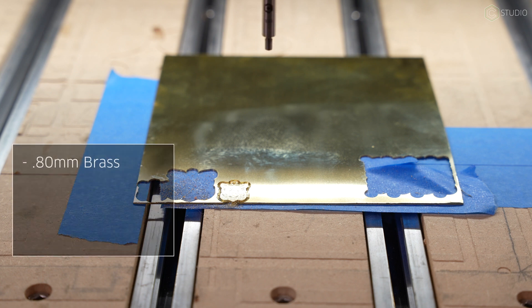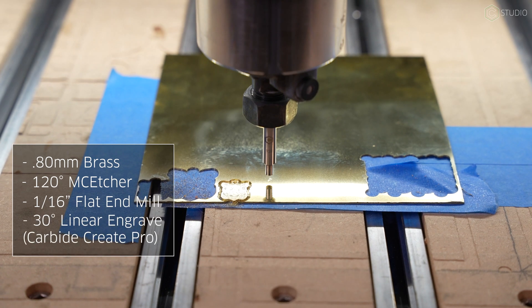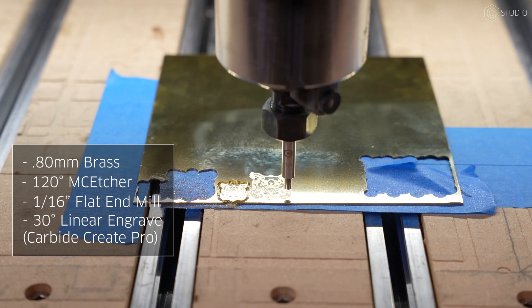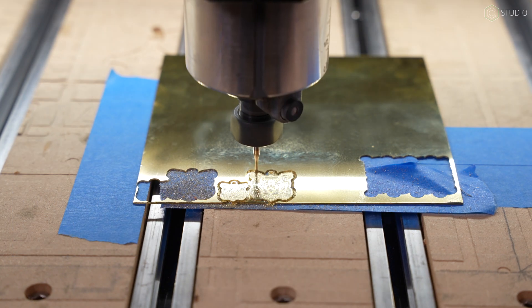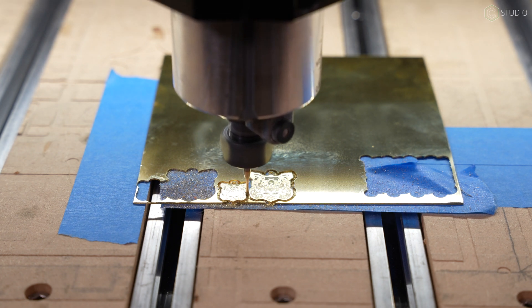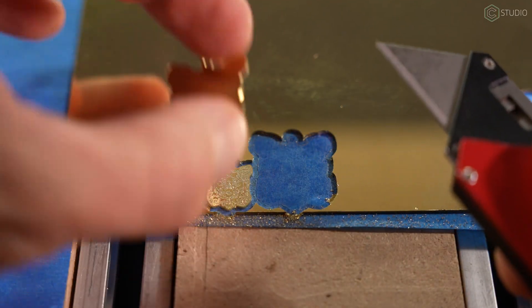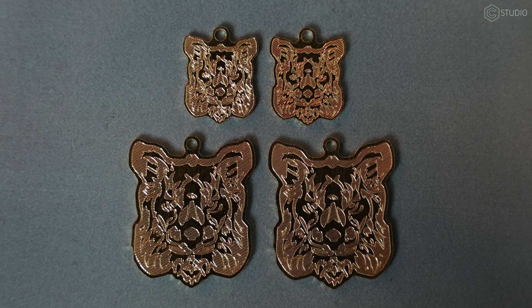The super hold kit is something you definitely want at your disposal. 0.8 millimeter brass, 120 degree MC etcher, 1/16 inch flat end mill for the cutout, 30 degree linear engraver. I like to pre-polish the plate, then post-production use a jeweler's rag to shine everything up — that way you won't buff out the detail you put in there with the MC etcher. Shapeoko handled this beautifully. Make sure you flatten your waste board and crank up the router on the cutout.